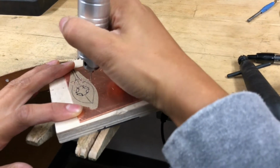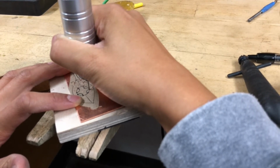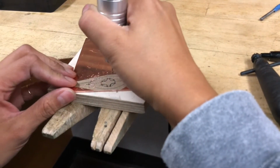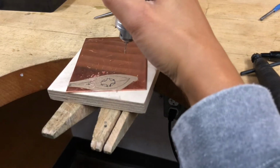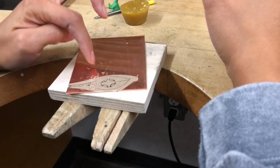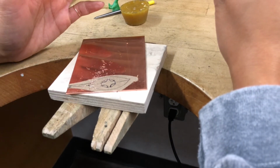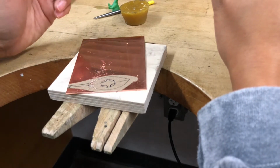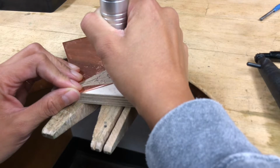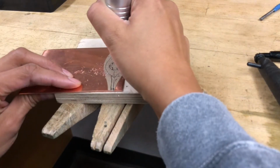Super awkward. Okay. So it's a lot faster, which is great, but the chance of you breaking a drill bit becomes much higher if I start wibbling it while the drill bit's going down, there's potential for breakage. You can see all these little bits coming off, and they're nice and long, which means that I'm applying a very consistent and the right amount of speed versus pressure. So it's a really good sign. So I'm pushing, I'm applying pressure down and then releasing, and that kind of cuts these little twirly bits of metal.